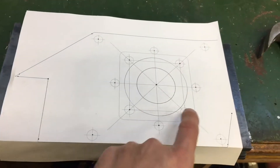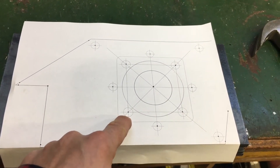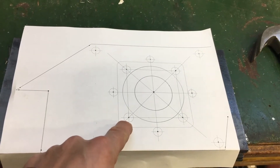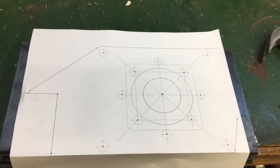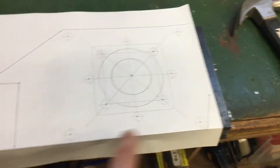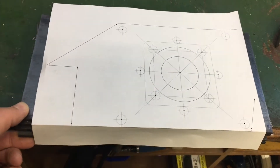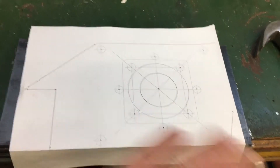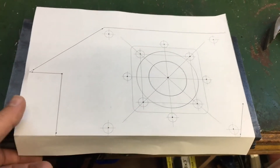There are four holes through the plates that will be used for the bearing mounts. The top, bottom, left, right will be mounting holes for the hydraulic motors. And then these four outer corner ones will actually be used to clamp the four pieces of plate together, just so that everything stays aligned while I'm drilling it. And then they'll also be used for assembly.